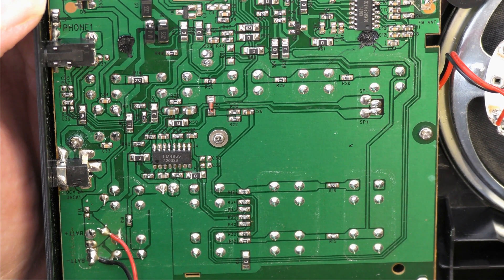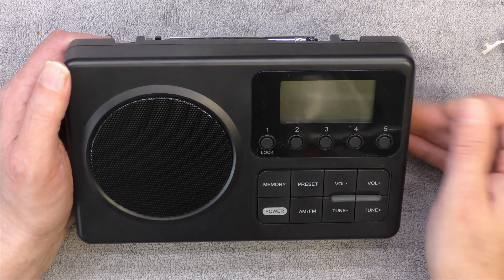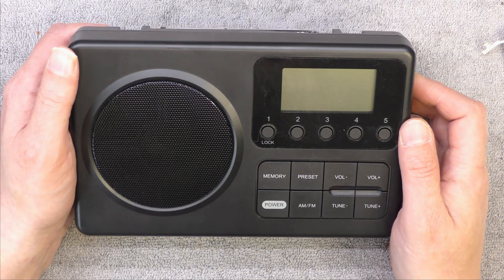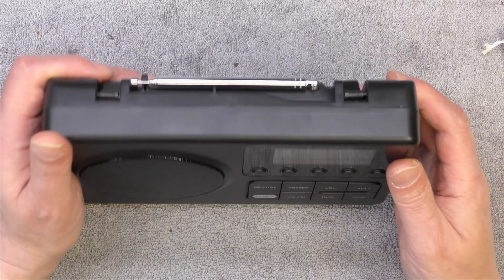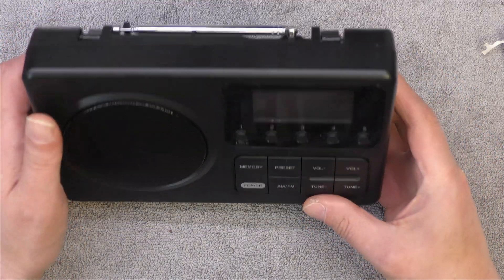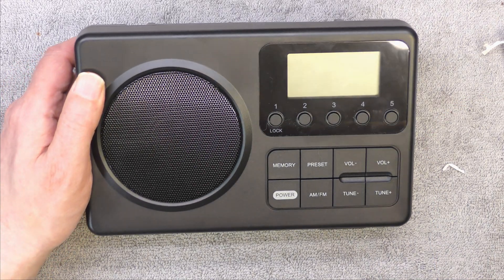For 13 quid it's got quite a bit of amazing technology in it — but then so has everything these days. Next time I'm working on a vintage radio I'll have to try and remember how simple it is. Apart from the digital noise at low volume it's actually quite a good performer. It works down to 2.7 volts and is still functioning. I reckon if you had it on lowish volume you'd get over 120 hours out of a set of D cells, assuming about 12 ampere-hours for alkalines. It's cheap, it even comes with a mains adapter — thirteen quid, pretty good effort. Thanks for watching and I'll see you soon.